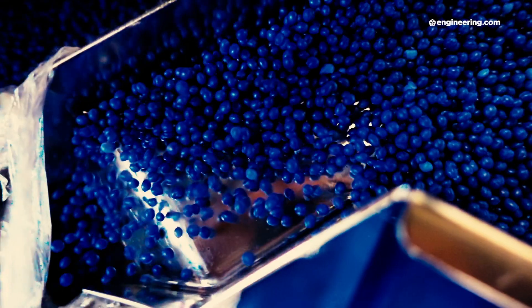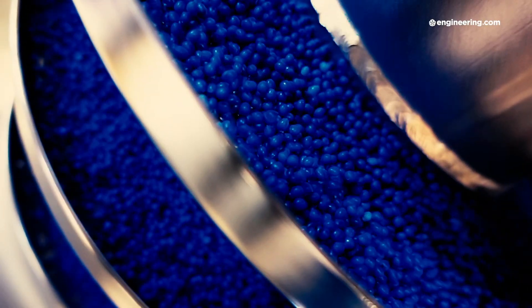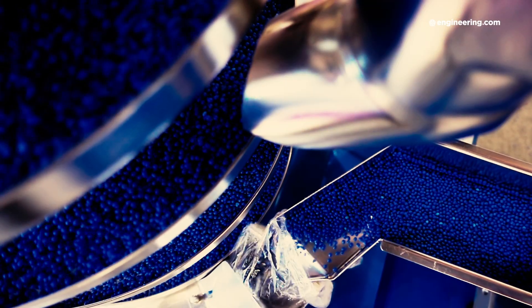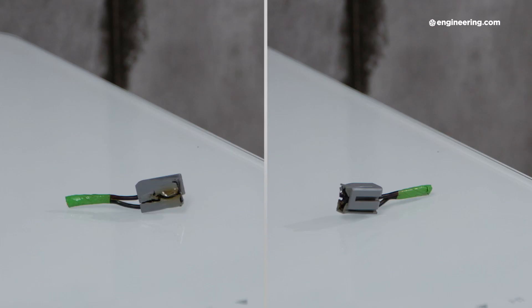In choosing the plastic resin, depending on the application, it may be as simple as a straight commodity-grade polyethylene — a commodity resin with additives for things like flame retardancy and color — or it may be a filled resin or even an engineering grade. The other end of this harness has a connector that spends its life immersed in gasoline, so you can bet that it's designed and tested differently from this underdash component. And of course, if possible, it has to be designed at the lowest possible cost, and with the greatest possible commonality with existing parts. That's a tough order.